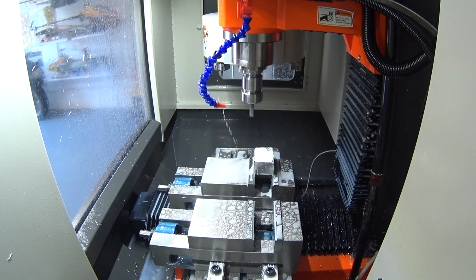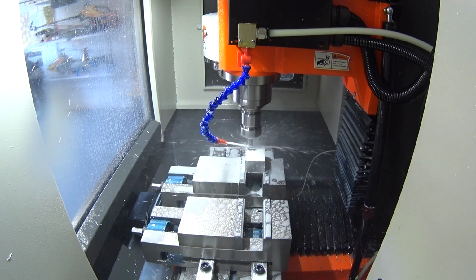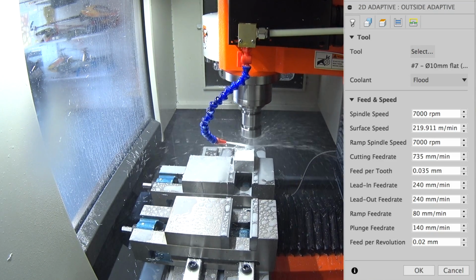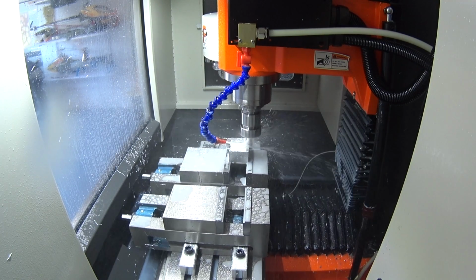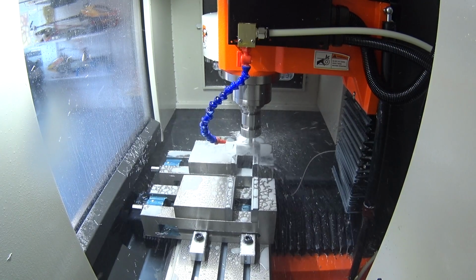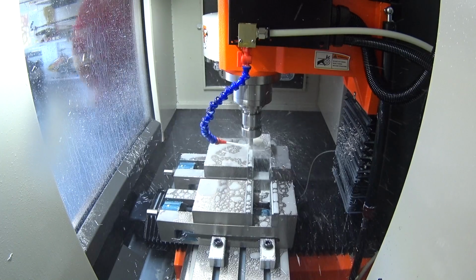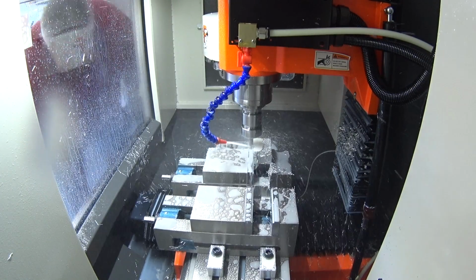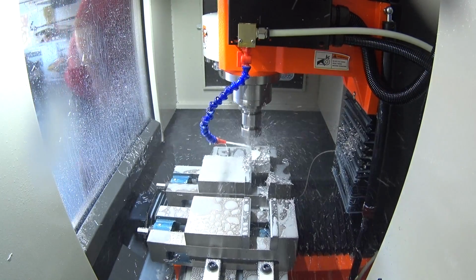Now to prove what I'm doing today, I'll do a tool change by using MDI command M06, I think it was tool 2 that I put in. And you'll see I'll jog down now, guys, and as proof of concept, I'll show you that that 0, 0 location is right in the corner of that. And if we go back to the CAM real quick, you can see that I've given that back left corner. And just to prove it, I'll zoom in and you can see it.